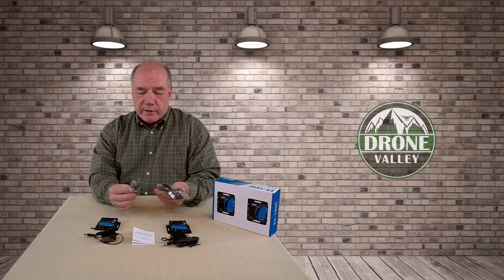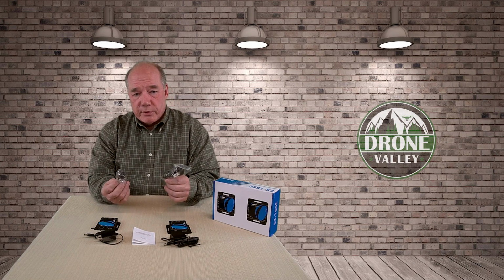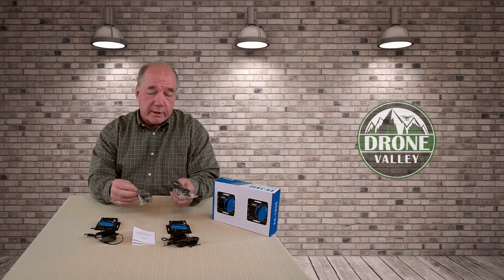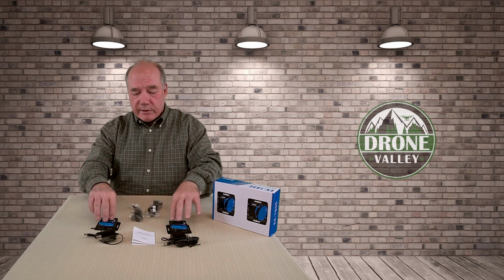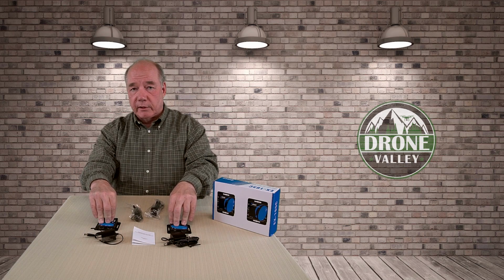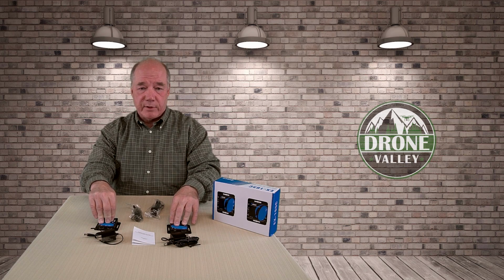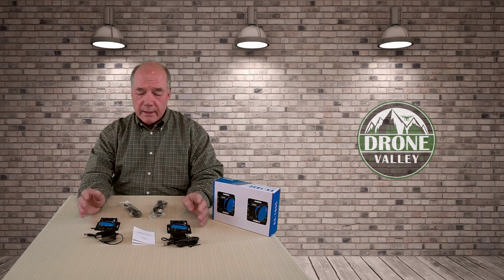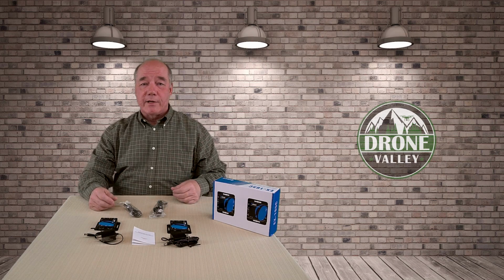These are the IR receiver and transmitter that you're going to use. Basically, one gets plugged in at the transmitter side, one gets plugged in at the receiver side. In addition to transferring the video signal over the Cat 5 cable that you're connecting between the two, it'll also transmit the IR signals from your remote control, so that you can control the device that you're actually watching up in the bedroom.